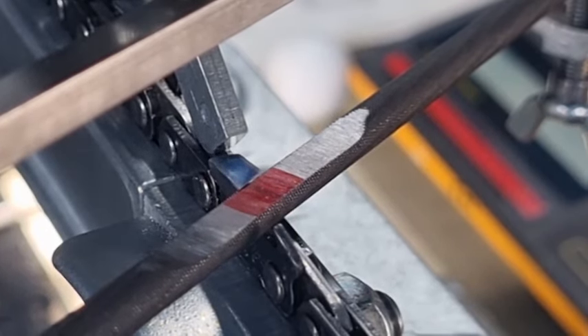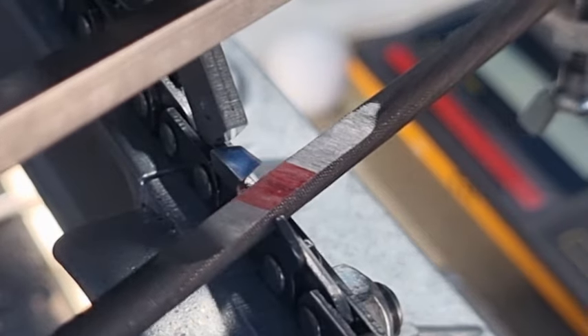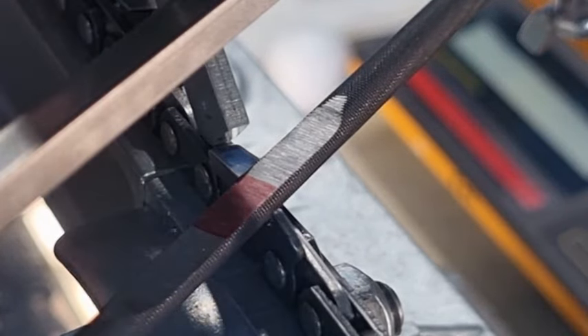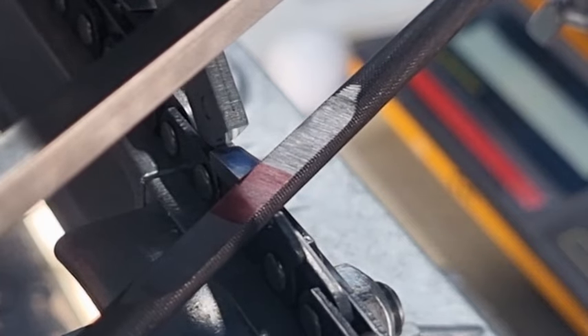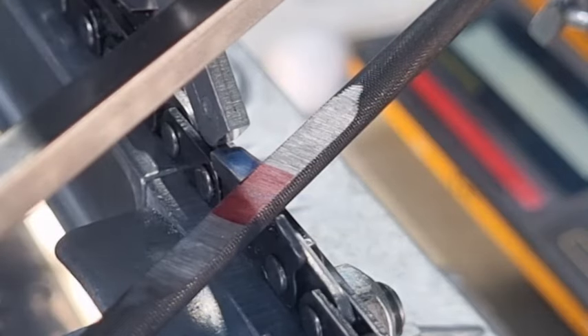In conclusion, the file guides work really well. Just be careful making your adjustment — that's 10 degrees downward tilt. If I bring it back to horizontal you'll see that the point of the tooth sits up a bit, so it's just a matter of playing with the adjustment and getting that set right. You can lift the file up or down, and you'll get used to it and find out what's the best position for you.